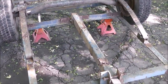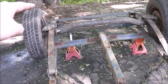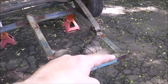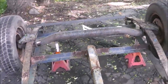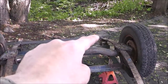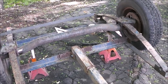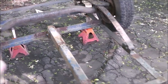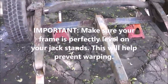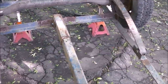If this was a brand new trailer or something we were building right from scratch, what I would do is build the perimeter of it on the ground, on a fairly level surface. I'd tack this piece to there, and then tack the piece across the back. So basically you'd have a square box, and then you're going to measure diagonal from corner to corner. Those diagonal measurements need to be the exact same. Once they're the exact same, then you can add a little bit more weld — I wouldn't completely weld them yet though. Then I would raise that square frame up and set them on jack stands, just like I have right here, because I don't like working on the floor. I like to work at a comfortable level. Once you have it squared, put it up on some stands so you can work on it and around it, and underneath if you need to.